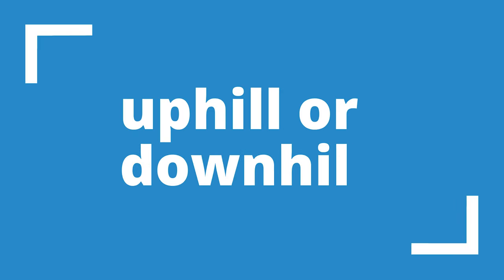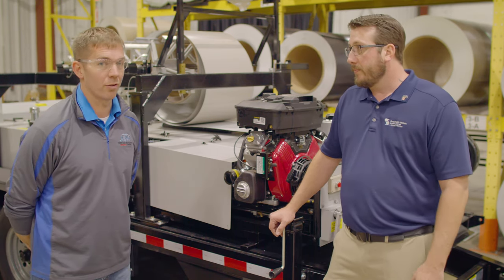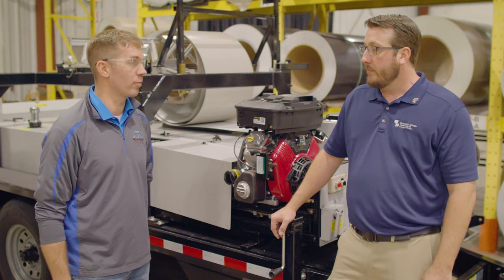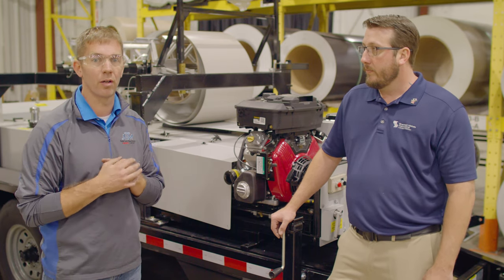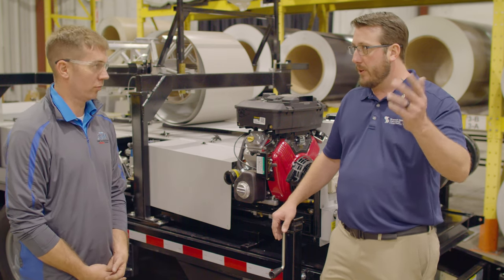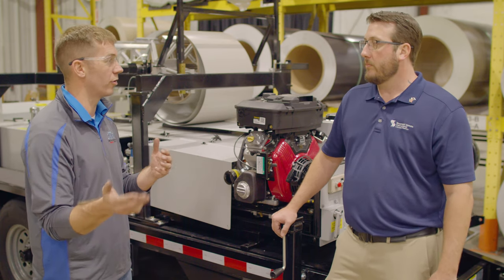Curvature in your panel — whether it's uphill or downhill — you can get curvature on one side of your panel. In our tooling sets, we have what are called camber stations that are generally at the shear end of the machine. Different profiles will either have one per panel side or possibly two. That allows you to raise and lower the rollers to straighten out your panel depending on whether it's curving uphill or downhill. You can have it just on one side — one side might be perfectly straight, one side might be bowing up. So it's always a good idea to run a sample panel, take a look at it, see which leg is straight or not straight, and only adjust accordingly.